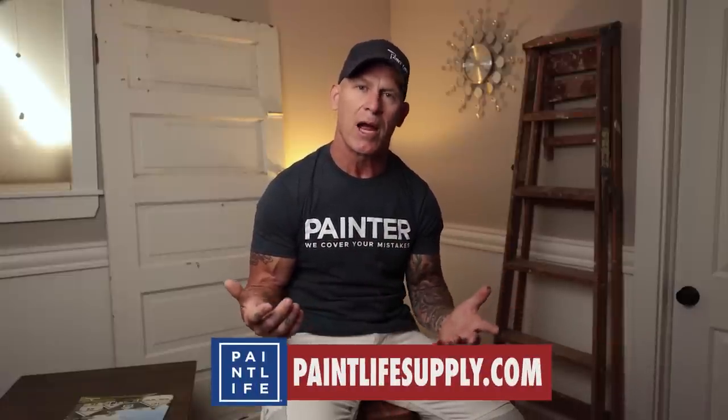The answer to the question I keep getting on social media — can I paint my vinyl siding? — is yes, you can paint your vinyl siding. You can actually paint your metal siding also. Proper prep is key. The paints I use don't require a primer, so you do not need to prime your vinyl siding if you're using a paint designed for vinyl. You can use a product like Benjamin Moore Aura, which will go on vinyl siding — it's self-priming and it's a one-coat product. Absolutely amazing. Pick a color off of the vinyl safe palette and you're good to go. Make sure you do proper washing, and if you've got a really chalky surface, add Emulsabond to the paint.